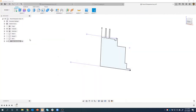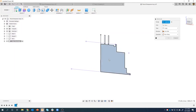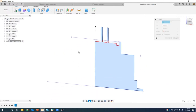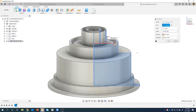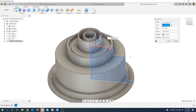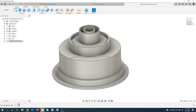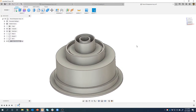I have my fully defined sketch. I'm going to finish my sketch and for simplicity I'll turn off the base. We're going to do a revolve. My projected line is cutting through my profile, so I need to select all three of those regions. Then this is going to be my axis - and you can see it took that sketch shape and creates a bunch of different shapes. Some people call it the cake method where they extrude each layer. But in something like this with how complex it is, I find the revolve command to be a little simpler.